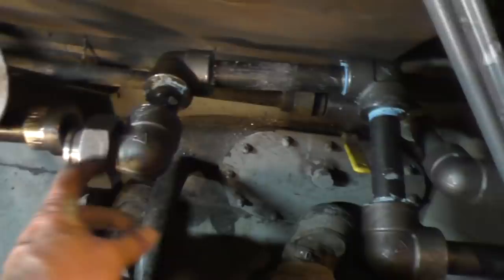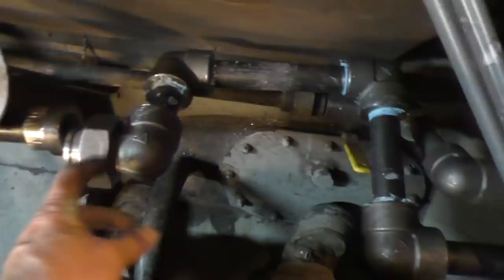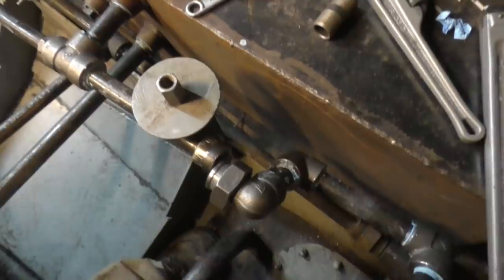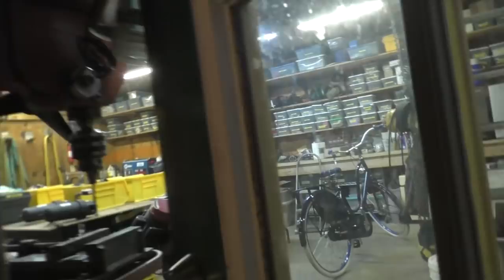The fix Chris gave us is to jog it off to the side - then it has a little bit of flex, so the pipe can actually move in and out because it has something to give. What we need to do tomorrow is heat this up a little bit right there and pull it a little sideways, or unthread it, put it in the bender and bend it. Me, I want to go with the torch. Cold winter night - not cold for the guy from Minnesota.